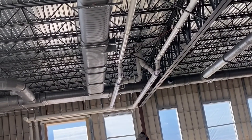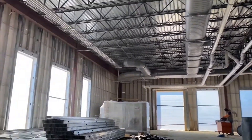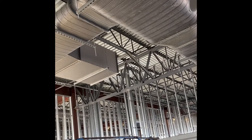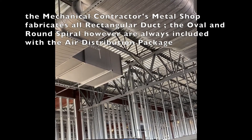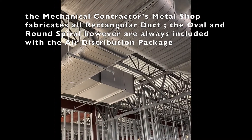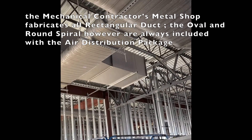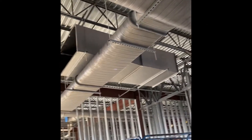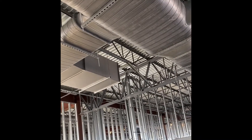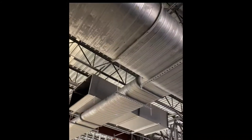We're going to have a coordination drawing. A lot of times we have a coordination drawing, but what they call a field drawing — we have an engineer at our office that draws on them in 3D. On the structure, typically we have like a 45-degree or a 60-degree angle. You can go with a lighter beam if you do more bracing than a heavier beam with a 45-degree, which would be less bracing. Our beam drawing has 45.